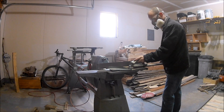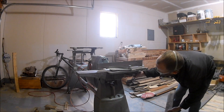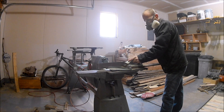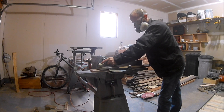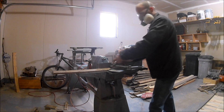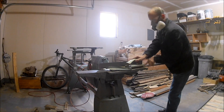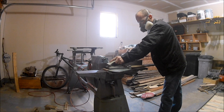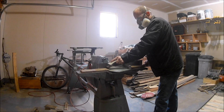With the sides jointed and the fence adjusted to allow a three to four inch board across the jointer planer, we can run them through on the flat side and take off the deformities to smooth them out and get a nice flat bottom surface to run through the planer. I highly recommend using a push plate — it gives you enough width to put pressure on either side of the board so you can keep one side down and allow the other up, which helps shave off a twist or cup.